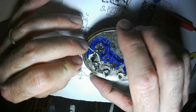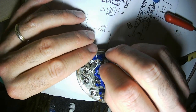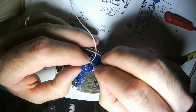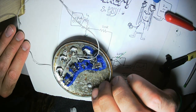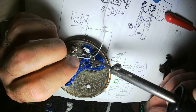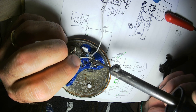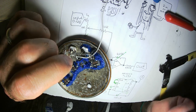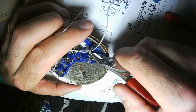And I've never really heard why it is okay to treat capacitors like this. I think the idea is that the voltage is generally small enough and transient enough. It's not lots of current trying to go into the wrong side of a polarized capacitor. And I've never had a capacitor blow up in an audio circuit. Keep your leads nice and short.